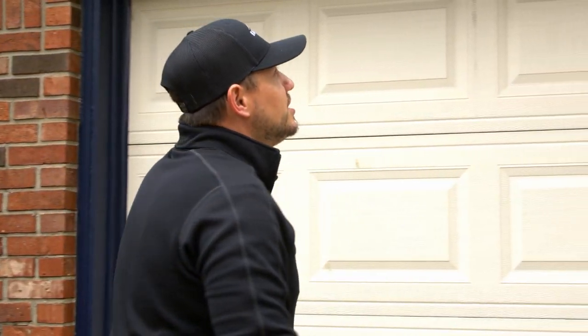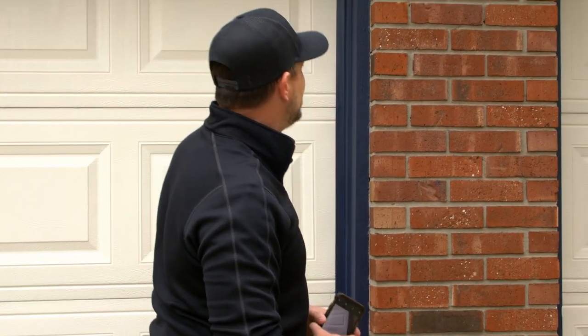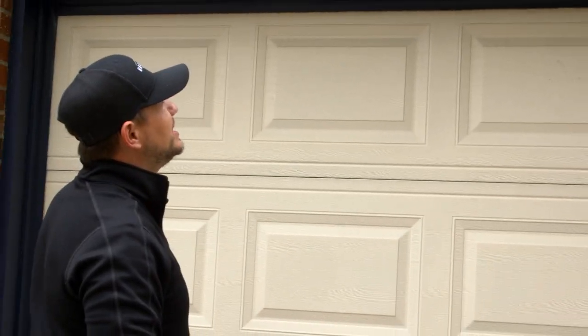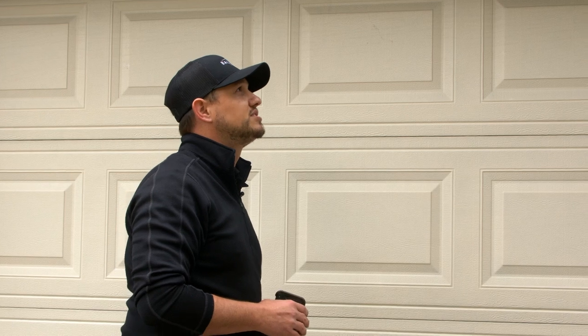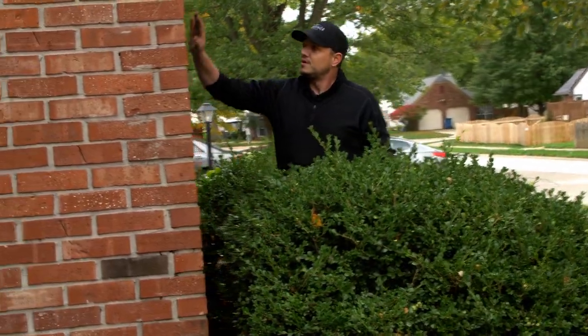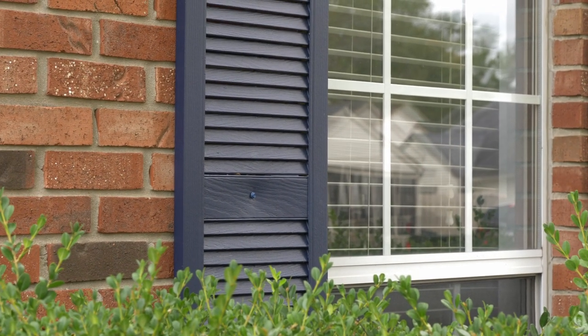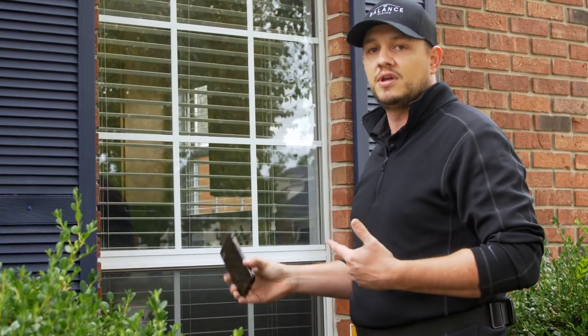Moving along, I'm going to walk this gutter. This house doesn't have any door wraps — it's all painted wood — so we're focusing on soft metals as we move down. The gutters don't look too bad; I see some dents from where they overdrove the spikes. I'll check the top edge of the gutter when I get topside. When you get to shutters, you're going to be looking for cracks in the slats — any fine cracks or fractures. Document those, taking a far-off shot and a close-up, so back at the office you know exactly which shutters were damaged on which elevation.